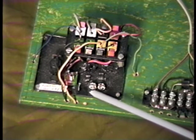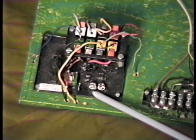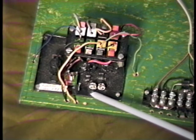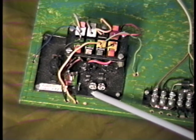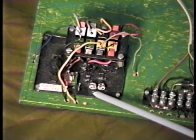The left potentiometer, marked with a T, is for timing. The time delay is adjustable between one second and two hundred seconds. That's the amount of time the thing will stay in the red state. When the block is in the green position and an engine passes over the electric eye, it activates the unit and puts it into the red state for that adjustable time period. After the time period expires, it goes back to the green state and remains there until the electric eye senses another train.